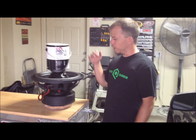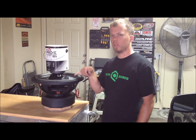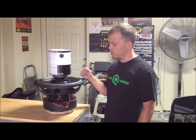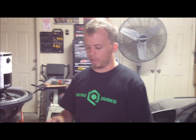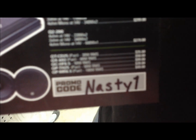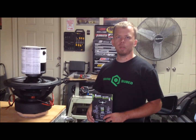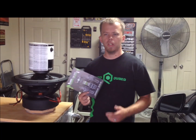Okay, that's it. Alright guys, we got the recone done. Pretty much the only thing I'm going to do now is wait about 24 to 48 hours for this glue to dry and set up completely. When it's completely dry it will be clear all the way through — that's when we'll know. Then we can actually put the sub in, test it, start playing it and breaking it in, loosen the suspension up, and start using it. Be sure, if you need to buy any amps, subs, or anything from SoundCubed, one of the coupon codes they're offering is NASTY1 — enter that at checkout and you'll get some free gear. Hope you enjoyed the video — let me know what you think about the recone process in the comments, and keep it loud.